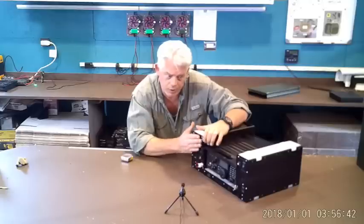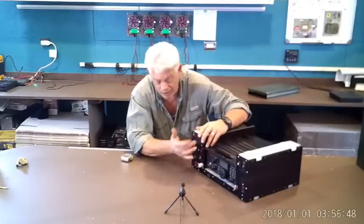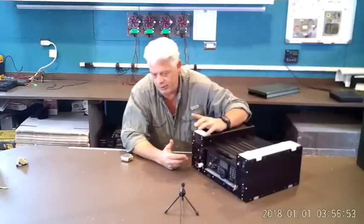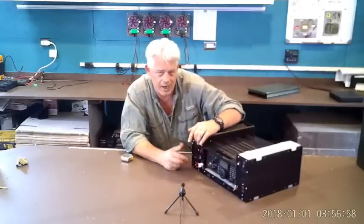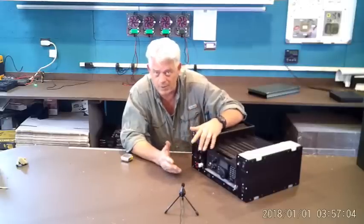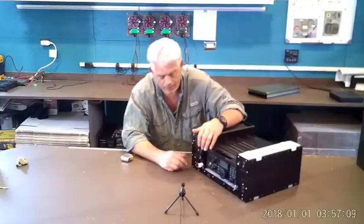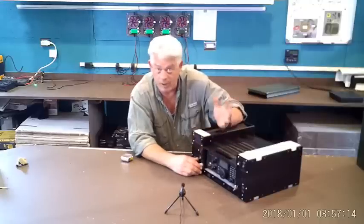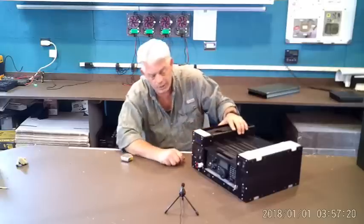We've got a power usage meter that shows you real-time data — power consumption. It records that data and resets if you turn it off, but it's really nice. If you key up, you can see in real time how many amps your radio is pulling. If you saw something you didn't expect — a lot more power being pulled, for example — you'd know to check your connections, check your antenna, or something's going on. It'll also track the total number of watts and watt-hours used, which can help with battery management. You can charge the system while you're using it — from solar or from AC.